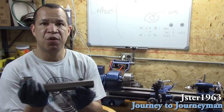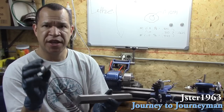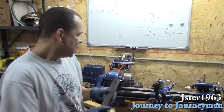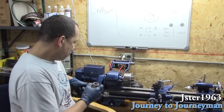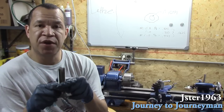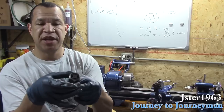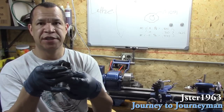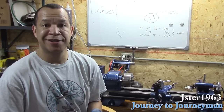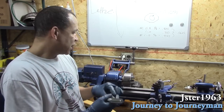I cut it, screwed this piece up because I drilled the hole too big. I was so used to using smaller taps that when I used this big tap and felt a lot of resistance — well, it's going to give a lot of resistance. So I actually made it where it just slides right over because I opened it up too much. Measure twice, cut once — goes with this as well. So I made a second piece, and it works like a champ.